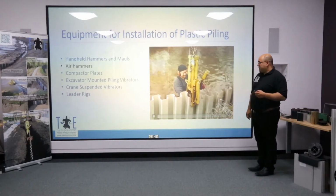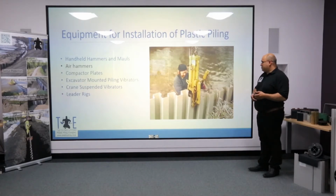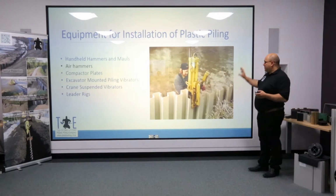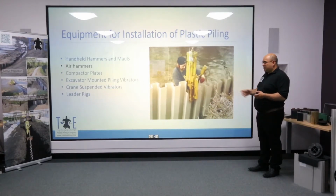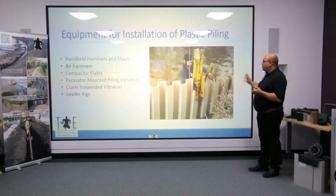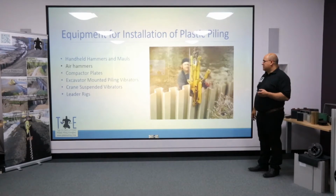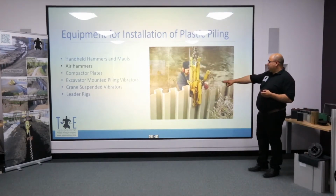This video shows the installation of plastic piling at Drayton Manor. They basically pushed them in most of the way, and now we're just doing a finish drive. So rather than use the air hammer throughout the entire process, to make it a more quieter process, and because the ground was quite soft, they pushed the sheets in before finally just towing them in with the air hammer to get resistance. In this product here, you have the Euro pile.